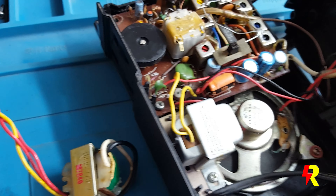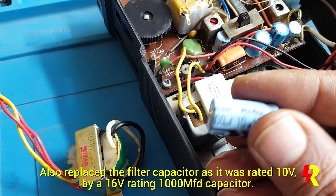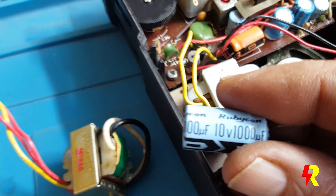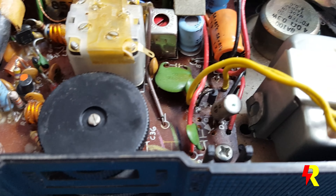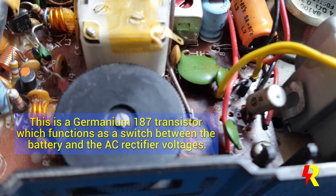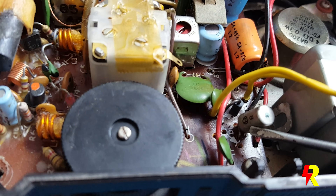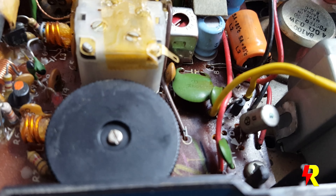I've also replaced the 1000uF 10V capacitor. I thought it would be better to replace it with a higher-rated capacitor, that is the 1000uF 16V one. You would have noticed that in this set there is no manual changeover switch from battery to AC power and vice versa. Instead, this set uses a 187 power transistor which functions as a solid-state switch for changing between the AC and the battery power.